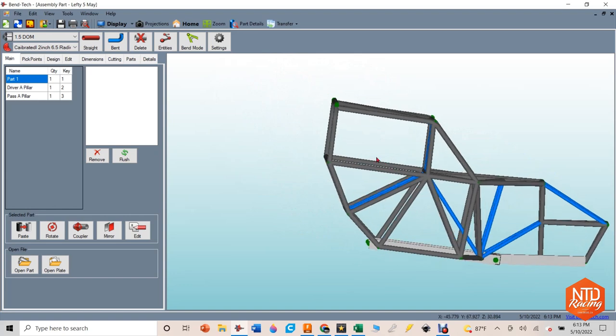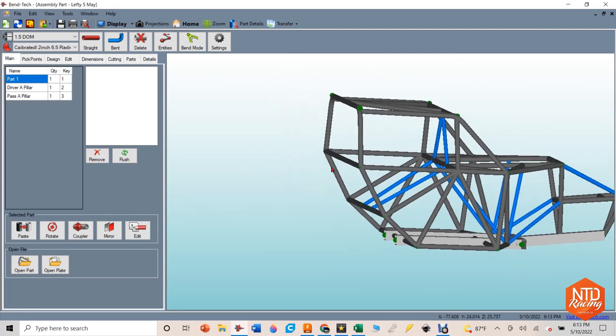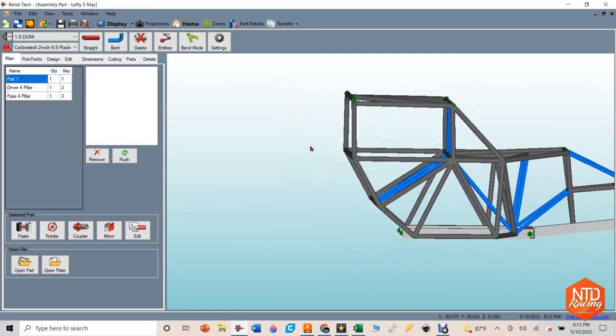The goals of this video are to complete the rear part of the roll cage. The big things we're doing are making a chassis that will locate the rear axle and ensure I have mounting points and geometry for shocks. That whole structure is going to dictate the ride height at full bump, and it's going to need to have bump stops. That'll just be a little bit of math and preparation.